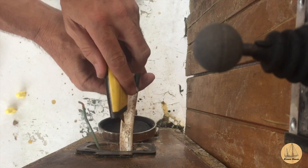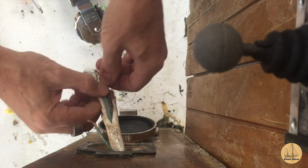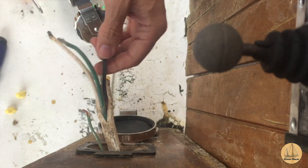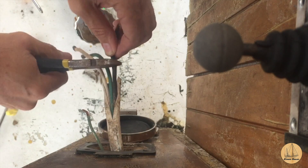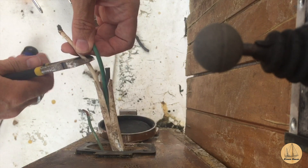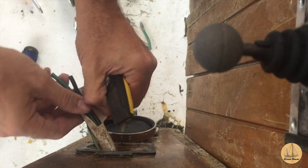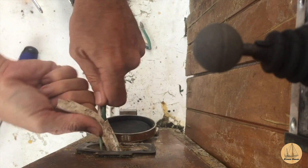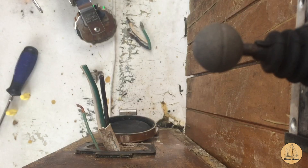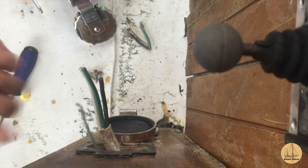As I mentioned before, I believe I found what the problem was. I'm now just stripping this back a little bit, and as you can see the cable is nice and good just a little bit in here, so I'm going to trim this back to the spot where it's good and do the same with both wires. I'm a little bit concerned about what this secondary ground is — it appears to only be jumpering between the ground on the secondary plug, but I'm going to go ahead and keep it the same way.